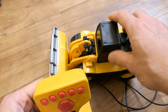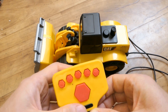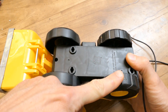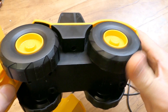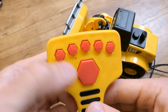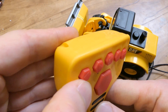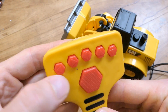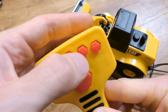A stop switch would probably be too much for two dollars. The other buttons don't do anything, and I guess those two buttons would originally move the wheels. The wheels are spinning completely freely, but those other wheels sound like they are connected to some motor via a gearbox — you can hear a motor spinning when I turn it, which sounds like a brushed DC motor. The buttons on the remote control feel like rubber contacts pressing a conductive layer onto pads on a circuit board. This kind of switch can't switch the motor directly because conductive rubber has high resistance — it's only good for microcontroller inputs or the base of a transistor.